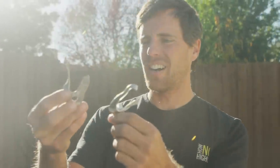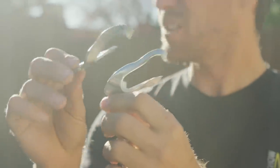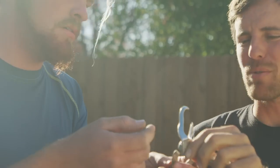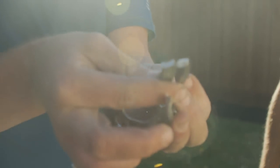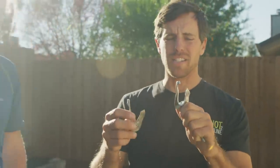Wow, 34 kilonewtons. It's about the same taffy shape. Oh, what do you think, Bobby? I think we may have been wrong about it being 400 stainless. It may have just like a different... Well, no, it's way more magnetic. Yeah, like the grain structure looks a little bit different, which it would if it was a different material. Yeah, this is 316 and this is 400. Well, that's nice to know that it's 50% stronger than they say it is.